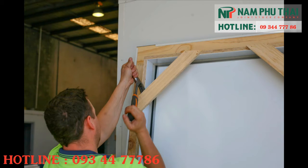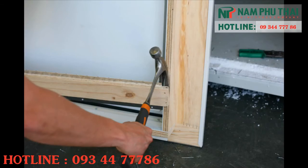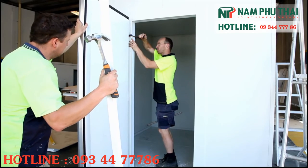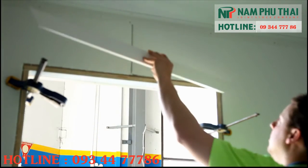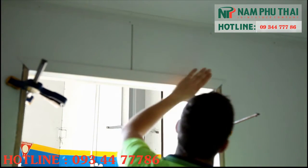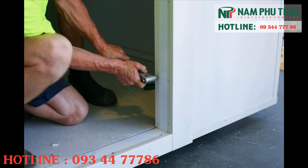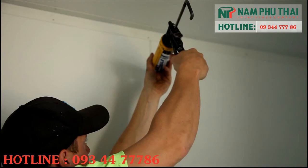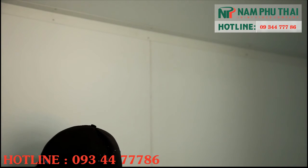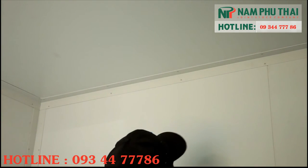Remove the wooden bracing and all the nails from the door. Next, we need to fit the door and clamp it to the wall. Measure, cut, seal and fit the internal angles to the internal side of the door, ensuring the door is tightly home and no gap is apparent. Check all levels. Seal all the internal gaps at this point.